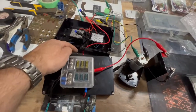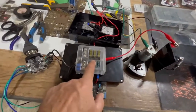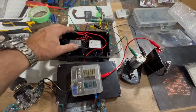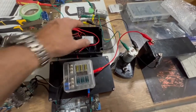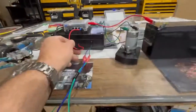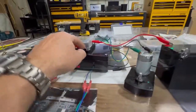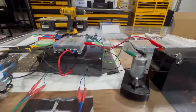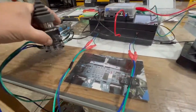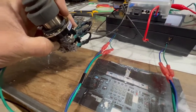I popped a couple of holes in the back here with some rubber grommets and ran them to a temporary battery. In this case I'm going to use a fuse block because I'm going to do some extra wiring. The power for the relays come out and I've got them on the fuse block, wired over to my battery. And the switching was so simple — absolutely simple. Just take all your negatives on one side like I've done here.